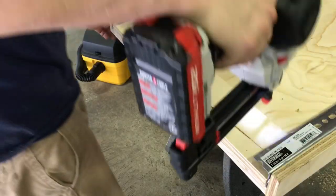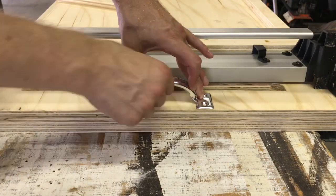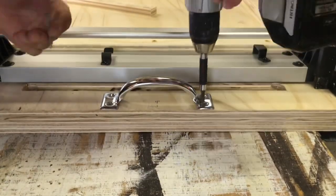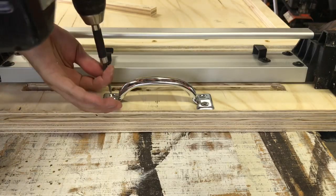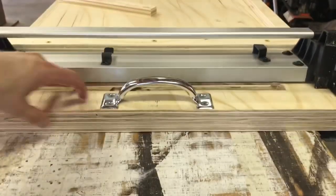See, I added plywood layers to each end so I could attach these gate handles for lifting the platform. And instead of using the short screws that come with the handles, I used some 1 5/8 screws that could grip both layers. It's a much stronger handle. This pretty much just left the wheels to deal with.